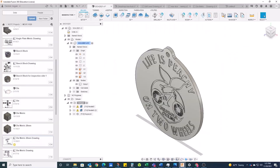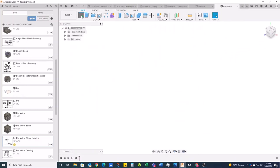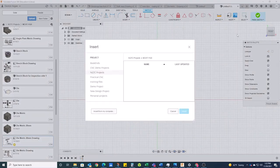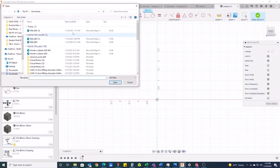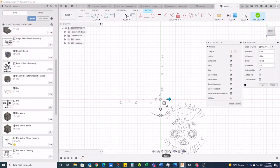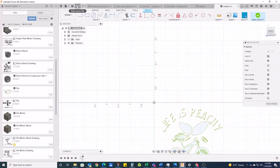Now I've got my SVG file, so I'm going back to my CAD system and starting from scratch so you can see how this works. I'm going to click Create Sketch and import my SVG file. I selected the surface I want to work on, go to Insert, and select Insert SVG. It's going to ask me where to find it, so I go to my computer, click Open, and it puts it in. Now you can see how some of this came out — I didn't quite get what I wanted. I lost some data, so I'm not going to use this one and will make some changes to my drawing.